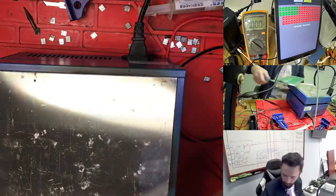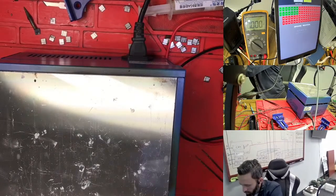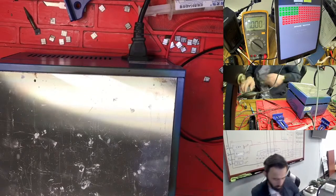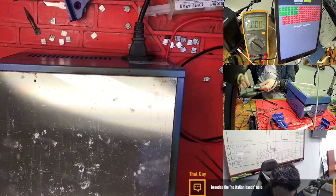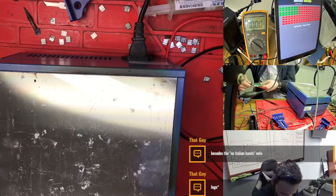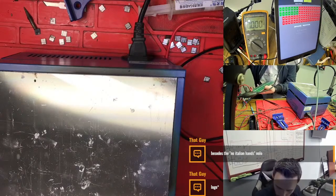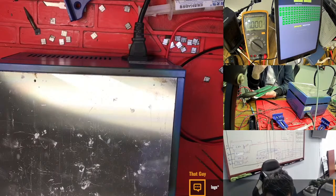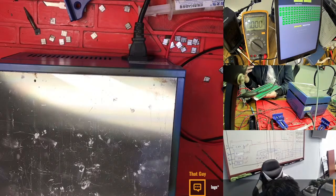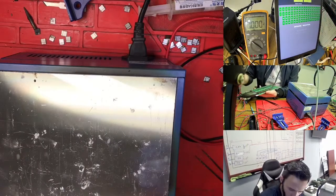So what I'm doing, I'm finishing all, and after that I'm testing again. This is all the same, so if one is good, fine. If anyone is not good, we try again. So this one 58, we just go quickly see, is it stopping in 58, you know? If it is 58, then we try something. We just need to check. So this one is good, we need to wait some minutes. But 58 is clean, so nothing is here. So one of these hashboards is good, so we don't need to work with this one.